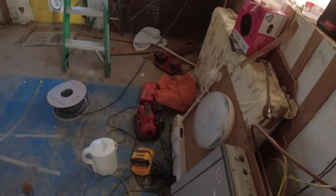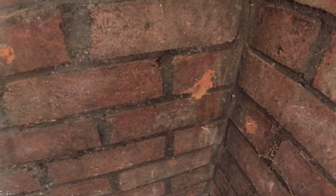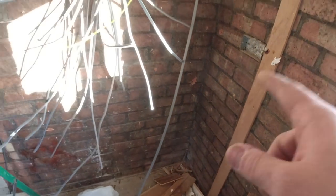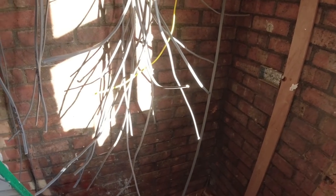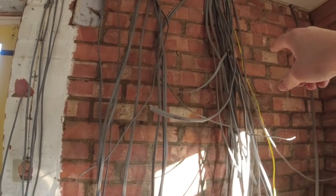There it is, 6mm. I'm gonna come down to there, turn that radio off. 6mm down to there, out for the EV. We'll put it on a whisker for now because they haven't got the car yet, but they're gonna get it in the future, and then he's gonna loop up into our board.